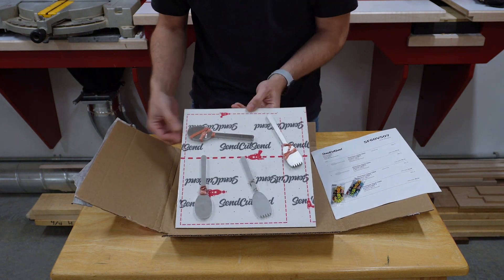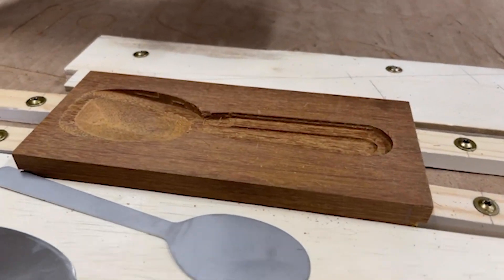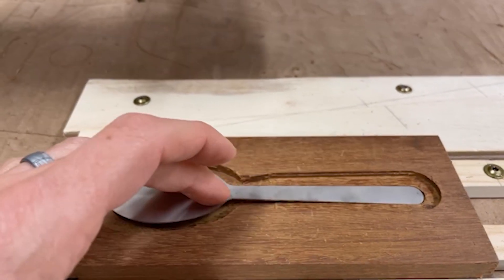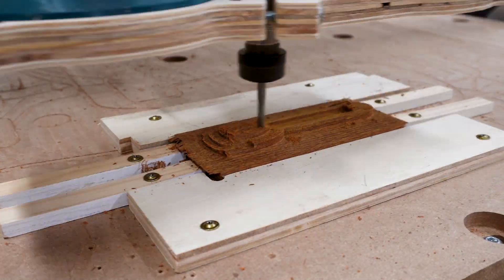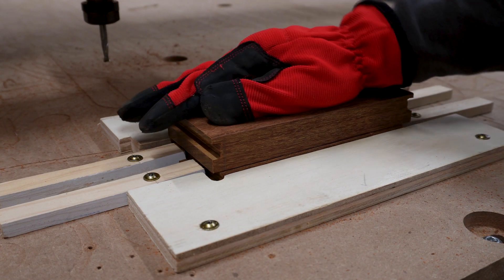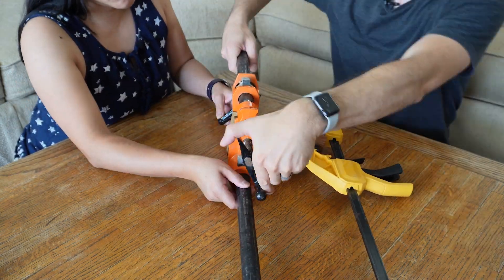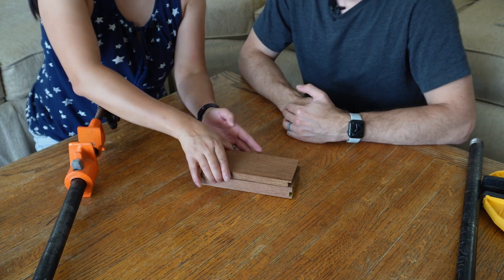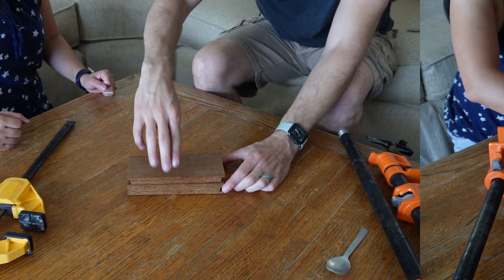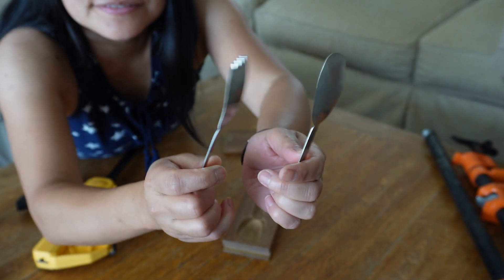And there are our parts — two sets of spoons and two sets of sporks in different gauges, so we'll see how they fare on the die that we create. The finished die block looks really good, and both the spoon and the spork in the two different gauges seem to fit really nicely. Now we can cut the die punch. The process is quite the same: I start with a roughing pass that removes a bunch of material, then run a finishing pass to cut the exact shape. Before removing the punch from the CNC, I test the die blank for fit. Now we can really see if this thing works — and it does. All that's left is to put these to the test. Let's go on a hike.